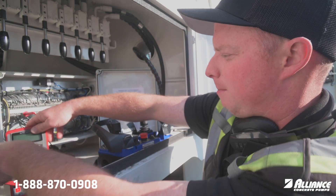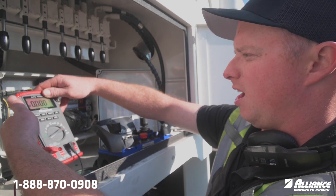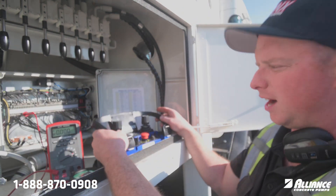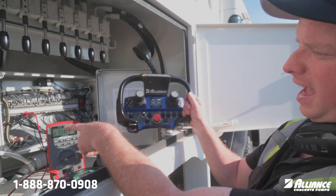When you turn on the multimeter to the amperage setting — this is dual range DC and AC — we're on amperage. Right now we have nothing because the remote's off. If I turn on the remote, we're going to gain amperage there.